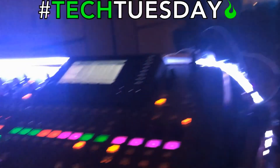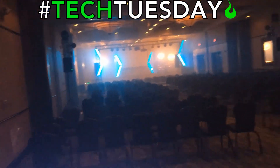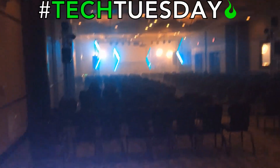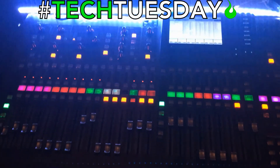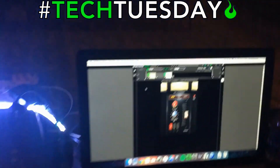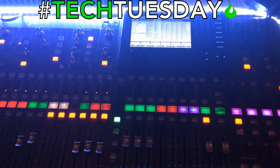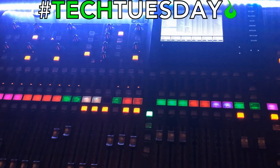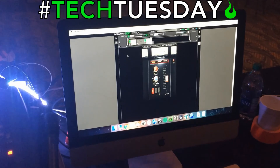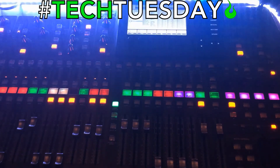Let's talk about the routing. Our sound is coming from the stage — we've got a couple of digital snakes up there sending signal to the X32. The X32 is setting the analog gain, sending it through the card to the computer. The computer is doing its magic, sending the signal back through the card, and then the board is set to send out the card signal, not the digital snake signal. That means we are hearing directly what's coming from the computer. Now, there are a couple of bad things about this: if anything were to go wrong with the computer, you're going to lose all the audio.